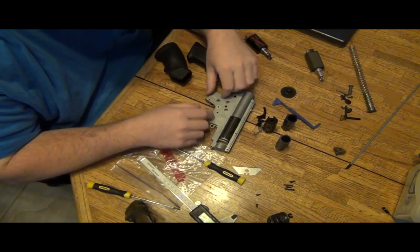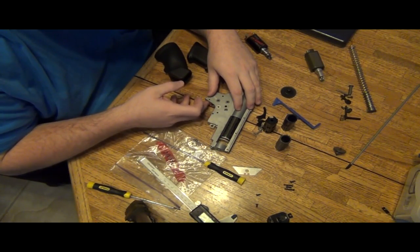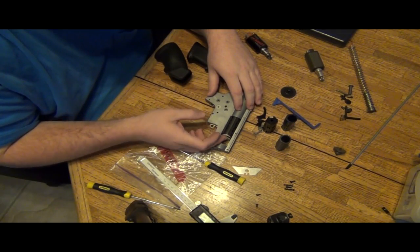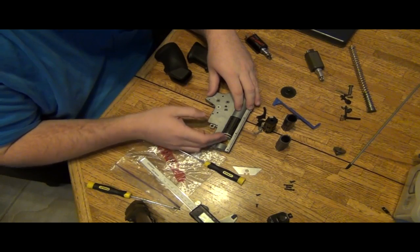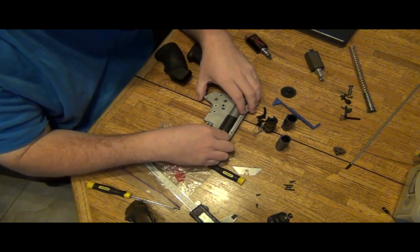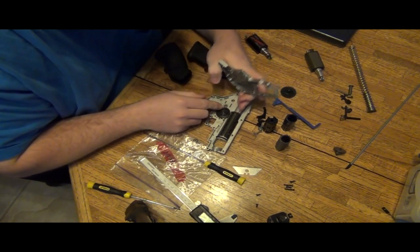Close it up, screw it down, and you'd have your bevel gear here and you rotate that with the spur once you've got this shimmed. You check your pinion and see if it goes back the way it's supposed to. See, it's got resistance. See that? Open up our gearbox here and see what is going on with the resistance. Well, it's at a different tooth location.